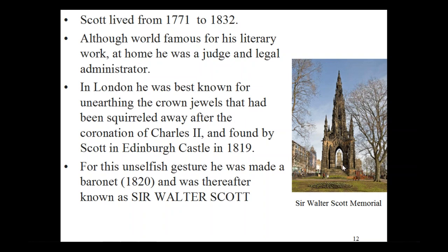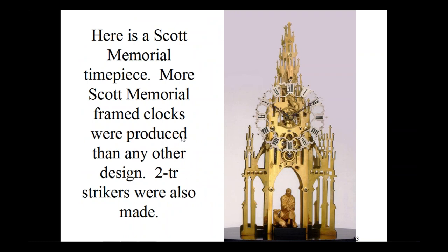Here's an example of a timepiece. You can see Sir Walter and his dog showing in the open area of the memorial, just as in the real memorial. This one has a vertical lever on the front plate, with a large balance wheel just a little over an inch in diameter. Evans used a robust cast dial. Later when we get to some Smith clocks, they tended to use thin material for their dials, fretted out with a jeweler's saw. But Evans typically cast his dials and then finished and engraved them with the numerals.